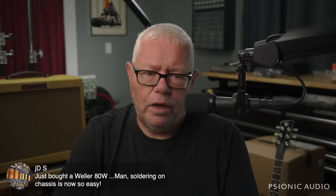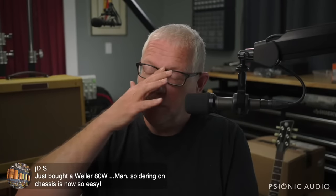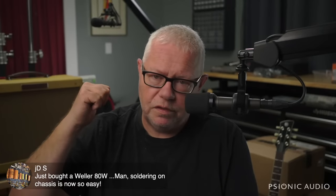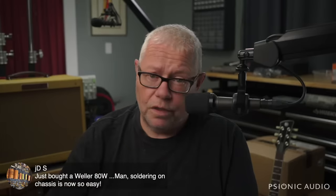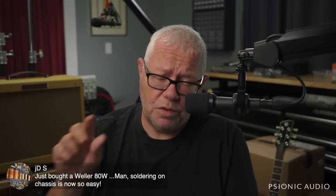JDS bought the Weller 80 watt. Man, soldering on chassis is now so easy. I've been telling people, you can't do it with a 40, 50, 60 watt iron, and you don't want to do it with a 120 watt iron. That's too much in the other direction. 80 watts is a sweet spot.